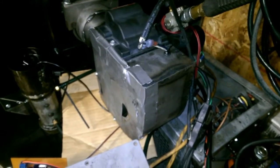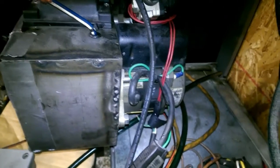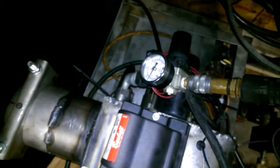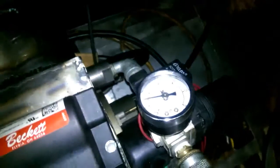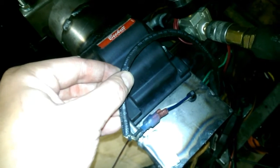The burner housing is homemade — it's kind of welded up a little shoddy, but it does work. I had an old leftover Beckett fan motor and squirrel cage fan, so that's what it runs in. Up on top I have the compressed air regulator, running on about seven to seven and a half pounds of air pressure, and a Beckett igniter screwed into the top. These two leads provide 120-volt power to the igniter, so when energized — controlled by the Arduino relay board — it provides spark ignition.